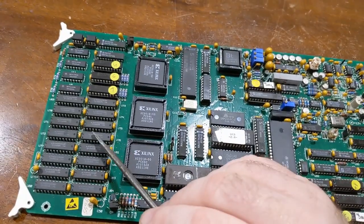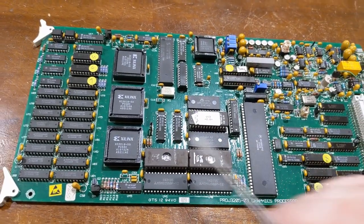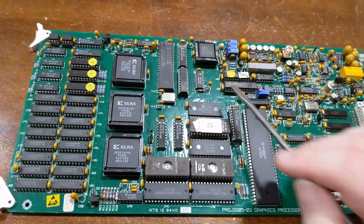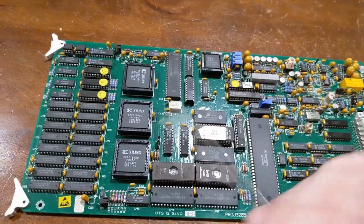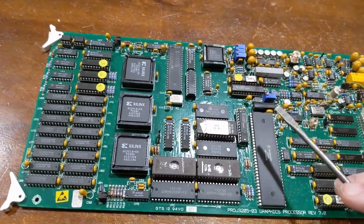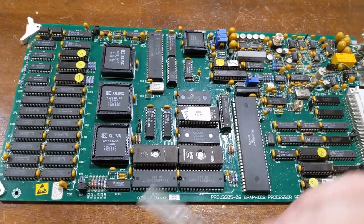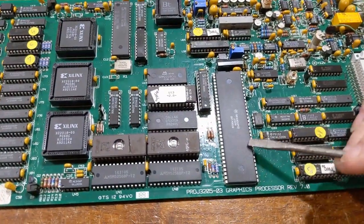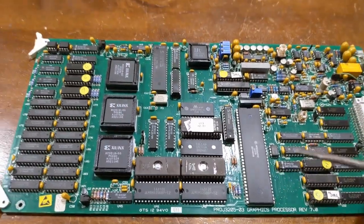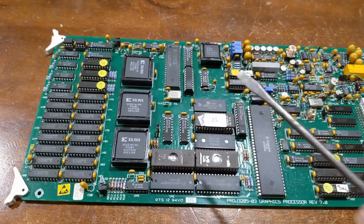And the read-write access to the memory, and that was one of the limitations of this design, is that this memory is not dual port. So this processor, to read and write to this memory, is interleaved with the access of this putting out to the frame buffer. That makes drawing really slow. That's why on-screen graphics for this thing is slow when it draws out, which it's only 8 megahertz to begin with. That's the clock signal. But still, it's slow to begin with because of the timing requirements for this thing to work.